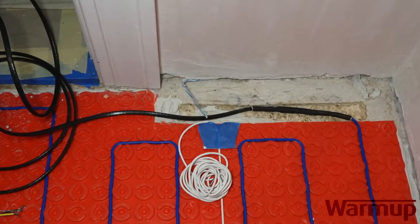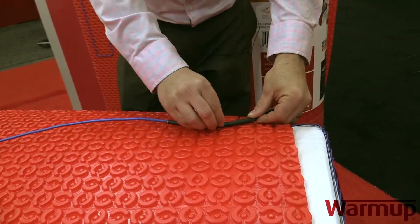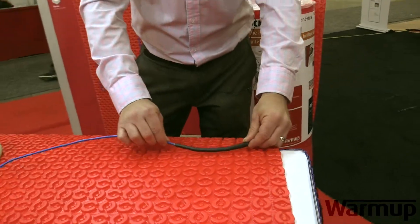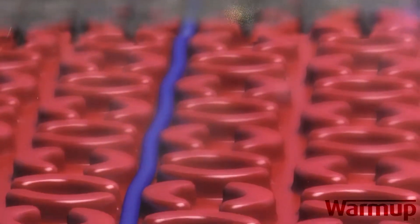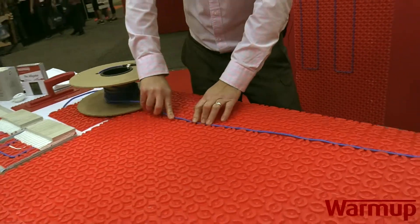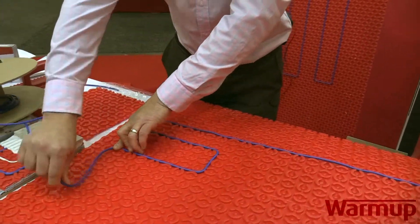This is important when installing. The factory joint has to be installed into the subfloor and also encapsulated with thinset, because it still heats up, and if it doesn't have anywhere to transfer the heat through, it will actually eat away its own jacket and loosen up the connection — very, very important. Once you have installed this on the subfloor, you can lay out the wire. The closer the spacing is, the more wattage per square foot you're going to have, therefore more heat, faster ramp-up time, and a little more efficiency as a primary heating source.